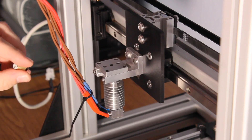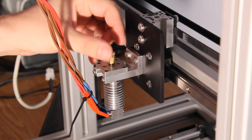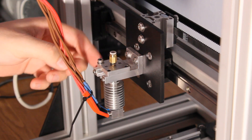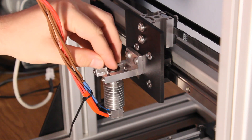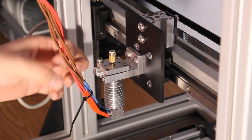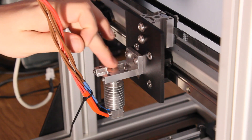This is just a brass fitting - it's a push-lock, 4mm outer diameter. I lost my PTFE tube, so I've got some more in the mail, but this guy just screws right in here and then I'm going to bolt this down. The one missing piece: this was designed to stand off a little bit and hit the J-head, which would stick out just a little bit, but when I went to redesign this I liked it better that it didn't stick out, so it's just a little bit below flush. I'll take this little spring washer, install it - it's got kind of an angle to it - and install the block right on top. I have to get the hole lined up just right before I clamp it down, so that'll give me nice spring pressure and act kind of like a lock washer without destroying my nice finish.